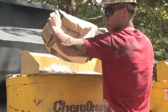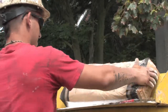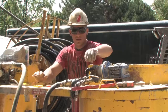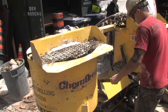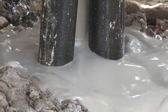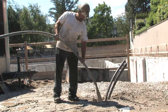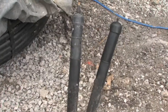After the loops have been cleaned with pressurized air and flushed with water, the rest of the space within the drill hole is filled with a thermally conducting selected grout that provides maximum contact with the surrounding earth. Once the liquid grout bubbles to the surface, the drill hole is properly filled. All drill holes are finely topped up and are ready for the next phase.